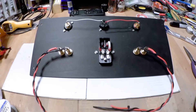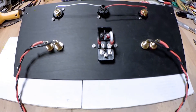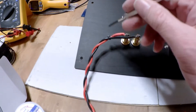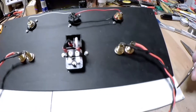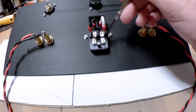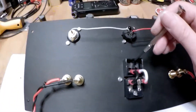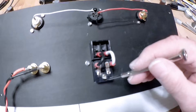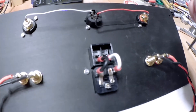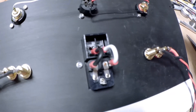So this is the back panel assembly, as far as I'm going to complete it until the amplifier's together. I have the speaker terminals wired up. I have the output of the fuse assembly going into the switch. There's still a line, neutral, and ground connection there. I already have the wires on the chassis set up for it — they'll just plug right in there.